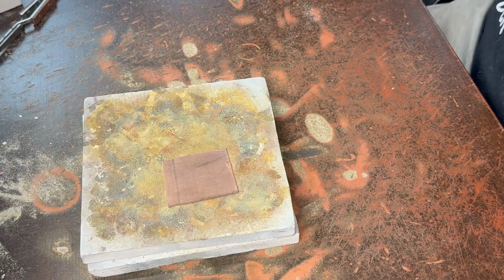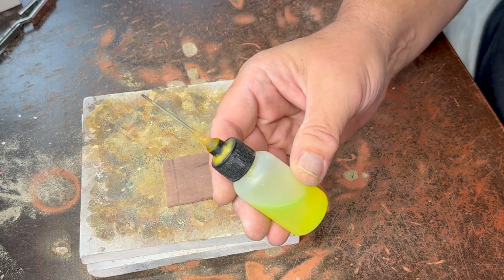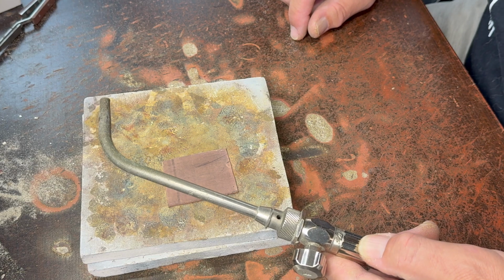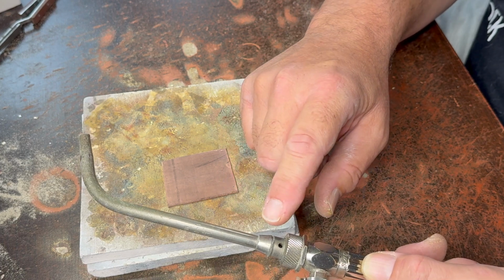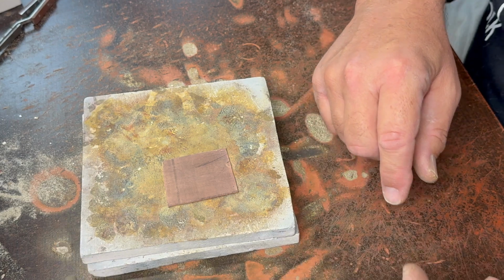And when you're squishing metal through something like that, it's really working it hard. While we're at it, let me talk about some things I normally do. I use hard silver sheet solder for most things. I use a liquid flux that I dribble on with a dropper bottle. My torch is a Silversmith bottle. It's their acetylene air torch. And it pulls in atmospheric air through these little holes and mixes with the gas and produces a hotter flame than, say, a propane torch, but not as hot as an oxyacetylene where it's pumping oxygen directly into the flame.